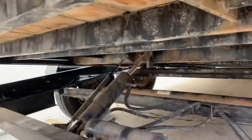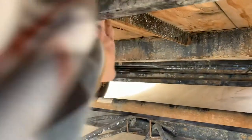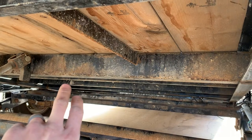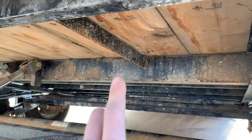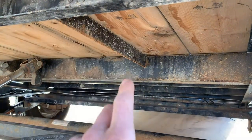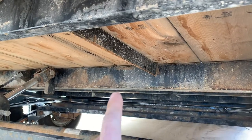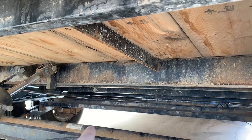And back here, which is kind of a problem. As you can see, we've added these supports — they weren't there before. We've actually had a piece of equipment break through the deck on this one, just because that span right there is so far. I think it's 22 inches with no support. So keep that in mind — you may want to add some extra supports when you redo your deck. We're on our second deck on this one.